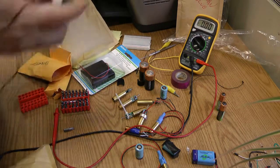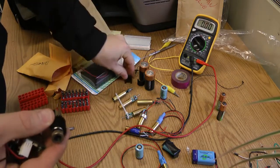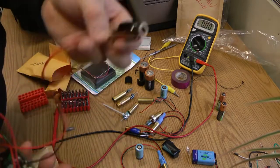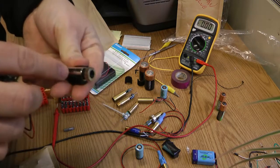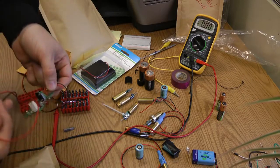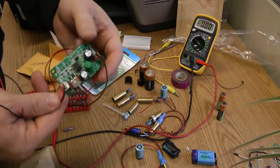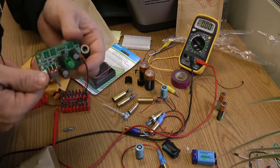Here's a more expensive laser driver. Right here is a heat sink — anything over 100 milliwatts you want a heat sink on. This 200 milliwatt laser actually comes with a heat sink, and that's what heats up on it. The driver is here, the diode is inside, and that portion heats up — that's why it has the heat sink. We're going to use this for a laser light show, but we needed higher milliwatts with the reds because red isn't as visible. These are the laser drivers I'm now purchasing for all my lasers — they work great.